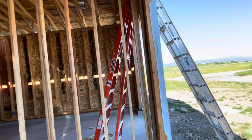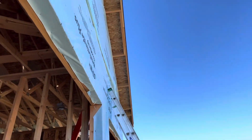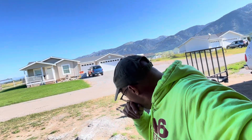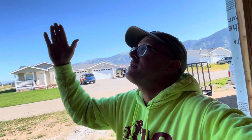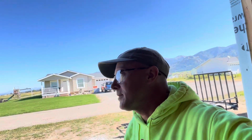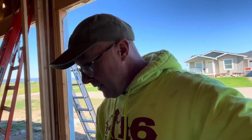And we had set our string line again up here. And we just clamped, and we worked our way across. Just closing, and that wall just went bloop, pulled right in. And then we just scabbed back and then added some more bracing as well. So it's perfectly vertical now. It was really simple. I mean, it took us an hour. And in my mind, I was like, the whole house is screwed up. So anyway, Harbor Freight hand clamps to the rescue.